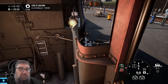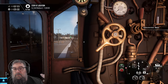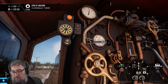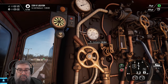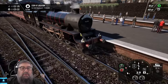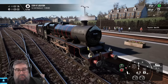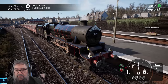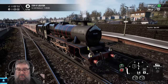Let's get back in the cab — doors shut, ready to go. Into full forward gear because we've got a train now. Release the brakes, open the large ejector to build our vacuum through the train, give a bit of a whistle, and away we go — just a gentle start here. Bring our cutoff back. There's no need to go too hard out of here because we have a rather low speed limit coming out of the station area, heading up the hill towards St. Erth.